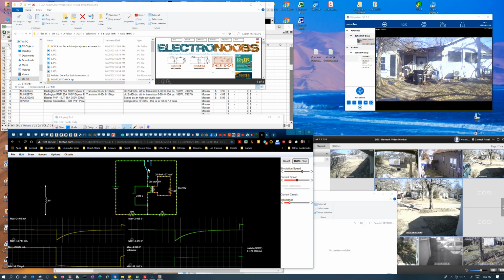So like I said, we switch it back to here. Okay, we're back to having a 2.5 volt thing again. But that's also shared with a 2.5 volt thing here. So it's like splitting the voltage, and I don't think that's a coincidence that these are the same impedance. But again, ultimately, we're still trying to get up to the same 50 milliamps overall. But like I demonstrated earlier, it's splitting the current, too. The current's peak is limited by taking 50 milliamps and dividing it in half, even though this ultimately does get 50 milliamps going through it.